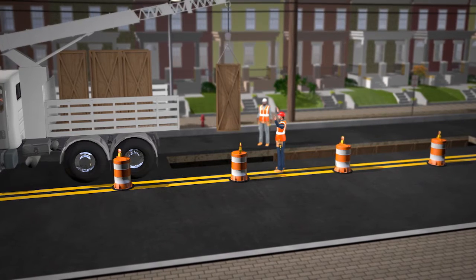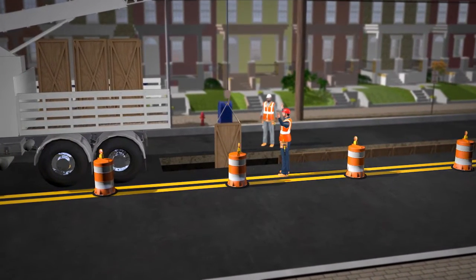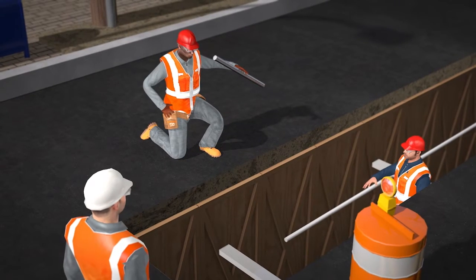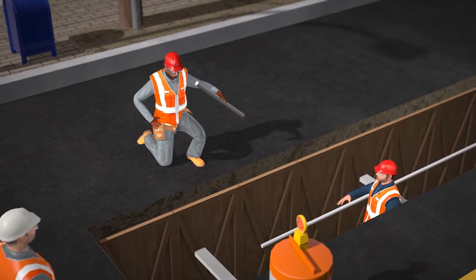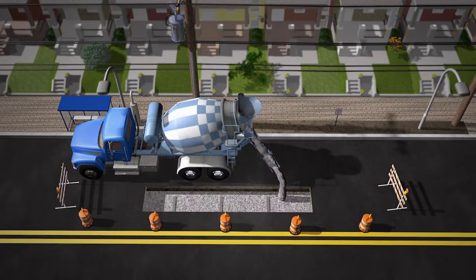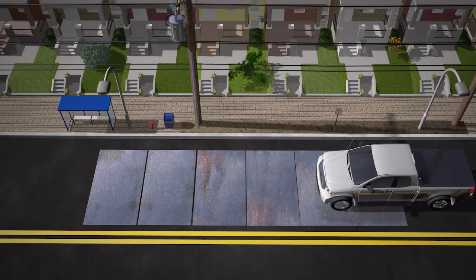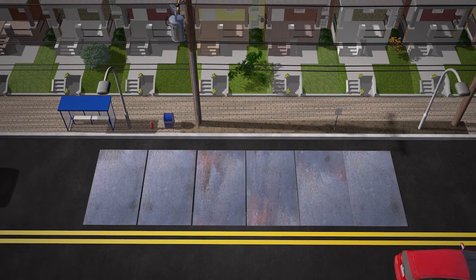In order to meet jurisdictional safety requirements, shoring will be provided in the trench to ensure stability. PEPCO uses either fiberglass or plastic PVC conduit to protect underground power lines. Concrete will be poured into the trench to encase and secure the conduit, and steel plates will be placed over the trench temporarily to make the road usable to vehicle traffic.